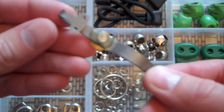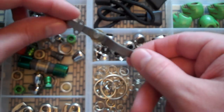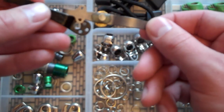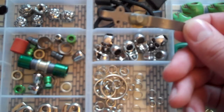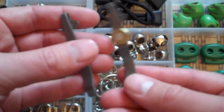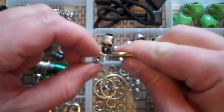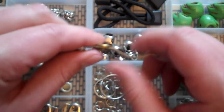I'll hit on this real quick. These titanium clips you can get pre-made from some of the knife-making websites. These are really great if you want to dress up your knife — you just have to be extremely careful with the hole patterns. Make sure that you measure it and get one exactly for your knife. You can get two or three of them for like 10 to 15 bucks. They're solid titanium and you can anodize them if you wanted to. There's little to no grip on them the way they come, so I pinch them down a little bit more to get better tension.